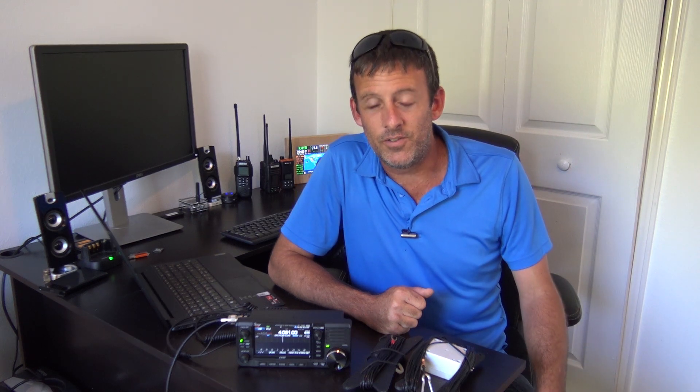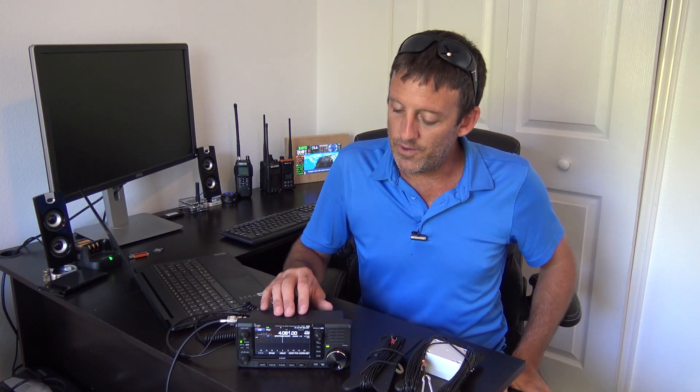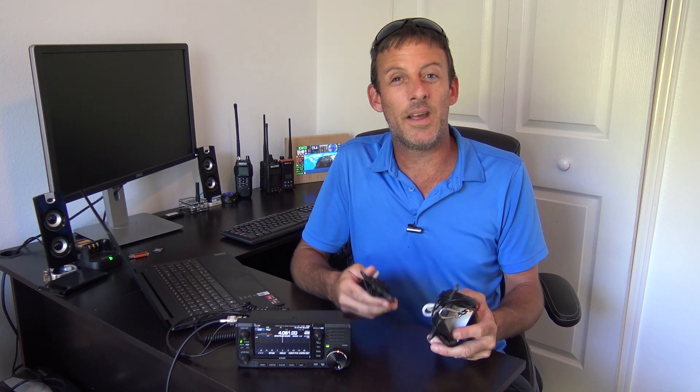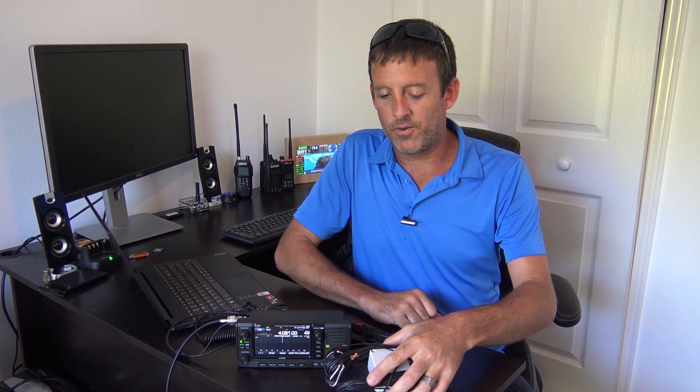The highest SWR I saw was 2.8 to 1, so if I had a little pocket tuner I might need to use that, but for my IC-705 always using this portable — this little 705 and this little antenna — that's it right there. I can do three things to describe this antenna: this antenna can make contacts, this antenna can be deployed anywhere, and this antenna could save your life. Imagine those who are preppers wanting that ultimate bug-out bag — an antenna that does 160 to 10 meters with very minimal setup and only a 73-foot footprint.